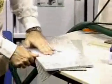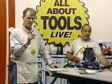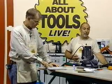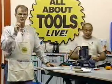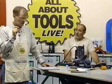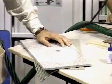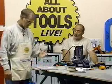There's a little hint of white. Now that can be caused from a couple different things. A lot of times what we used to do in our shop is we would clean up the edge of anything that we cut like that with a maroon Scotch-Brite and acetone. Because when you cut, especially acrylics, not so much polyesters or the hybrids, the acrylics tend to bruise and can be damaged slightly from the heat. The acetone dissolves that damaged surface area slightly. It removes a lot of the whitish mark, and then you're all set. You've got something that turns out really well.